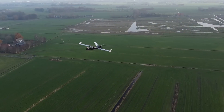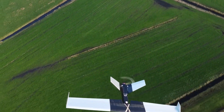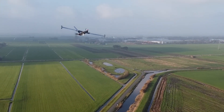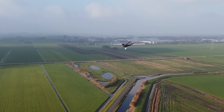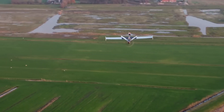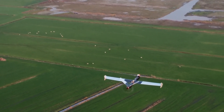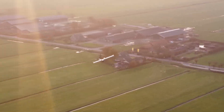The most important replacement was the flight controller. The old Matek F405 Wing, which worked flawlessly for about 2.5 years, finally showed its time was up and had to be replaced. After 30 minutes of cruising, the flight controller would randomly cut throttle and strike the servos with random PWM values, causing the plane to literally glitch in mid-flight and stall for about 3 to 5 seconds before I could regain control.